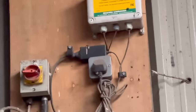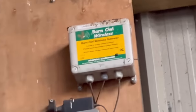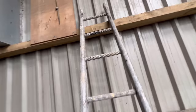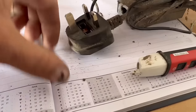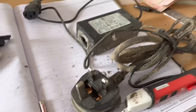I'm guessing the power supply's failed again — it failed a few years ago. There's no light on it. Hopefully the supply is under the rungs — I can reach up, that's better. Yeah, the green light's not on — must have burnt out. I've done this twice and carried a ladder. One of these power packs failed before — anyway, the fuse is gone in this one. If I put a fuse in, will it work or is it cooked inside? I'll go and get a fuse and see what happens.